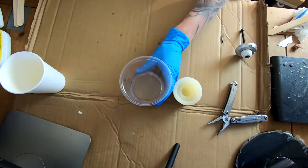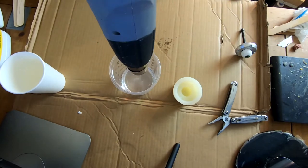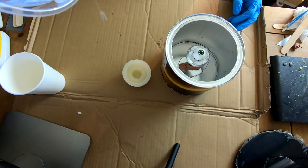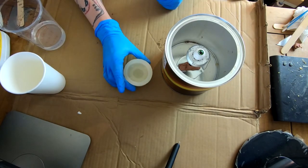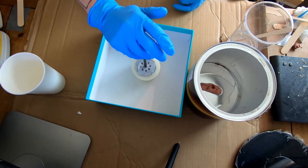The only issue is that they use a vacuum degasser, which obviously gets the air bubbles out. I don't have one of those, so I let this stuff sit for about half an hour and try to burst as many air bubbles with the heat gun there. Obviously it was on a cool setting, just trying to break the surface tension. I got most of them out. I decided to pour it anyway, so I'm just doing a layer on the eyeball and on the block and just filling up that mold there and trying to put it back in with as little air trappage as possible,